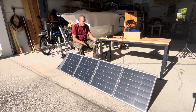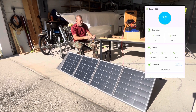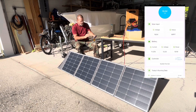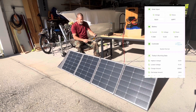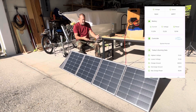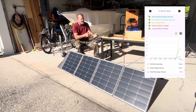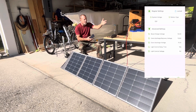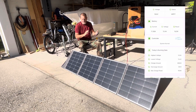We have this thing all set up. We have the app here — we're going to go ahead and put this app on the screen off to the side. You can see all the parameters on the application now. Solar panel is working — we have 13.3 volts in the battery. The solar input MPPT voltage is 16.6 volts coming out. We are putting in 151 watts of power into this battery from the solar panel. We have today's running information and some historical data. You can see the graph here — as that logs in, it'll maintain that memory in the charge controller. We have a parameter setting where we can set between lead acid or lithium batteries and do advanced settings like shutoff voltage.